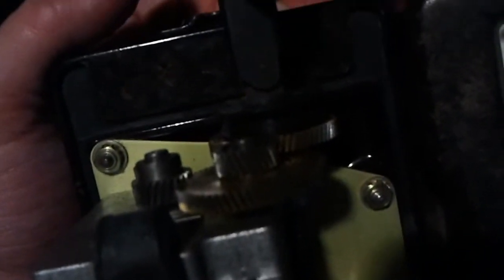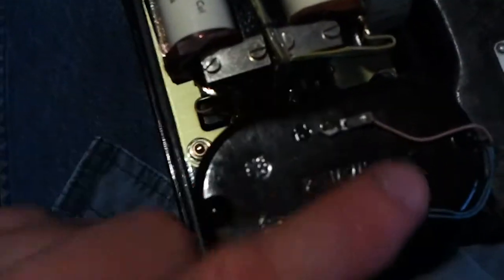Now, you can see this is your magneto crank. It's got a helical gear drive system. What you may want to do on the gear drives, I would recommend applying some grease. If you use OxGuard or Noalox, they're greasy enough to do the trick. Vaseline would be fine in regular climates, but if you're going to be in a high temperature climate like the desert, you should probably put a small amount of axle grease on them to lubricate them. Set of coils. This is the bottom of the battery box, the contactors coming out.